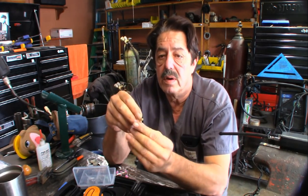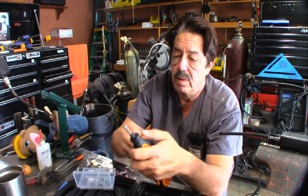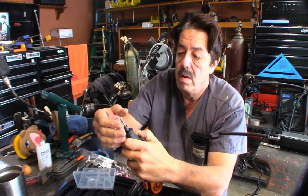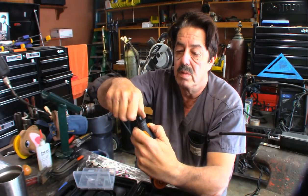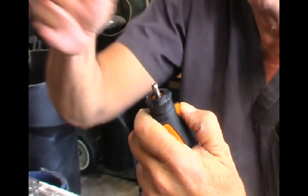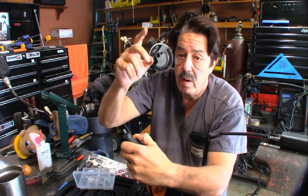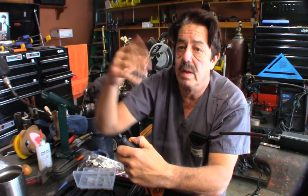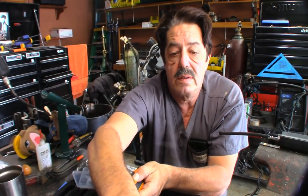You also get an extra collet in here, probably a different size. It's not hard to change out — you hold down the locking mechanism, loosen the nose piece, take the collet out, and swap in the other one. You can also buy additional collets online if you need different sizes. On my old tool I've never changed the collet — it's just been used indefinitely with no problems.